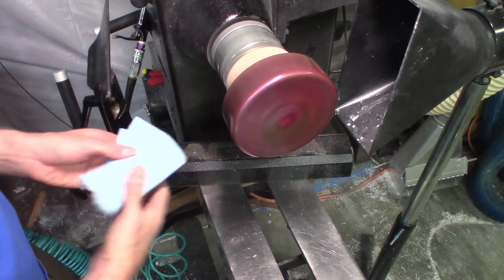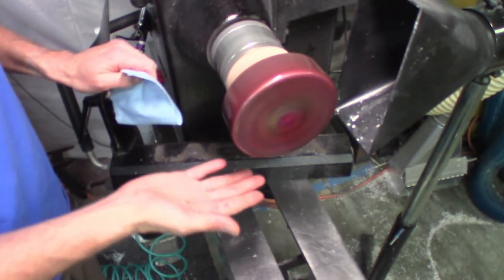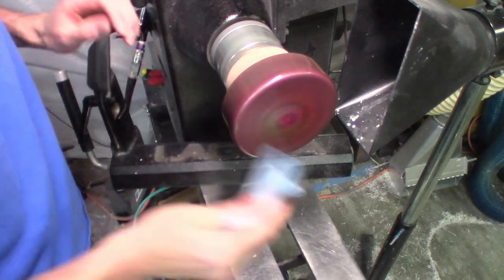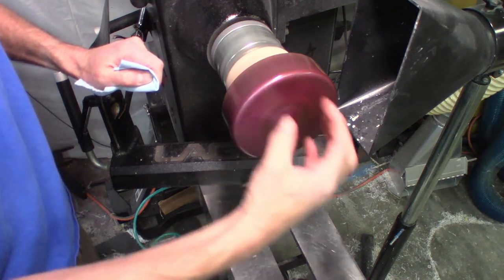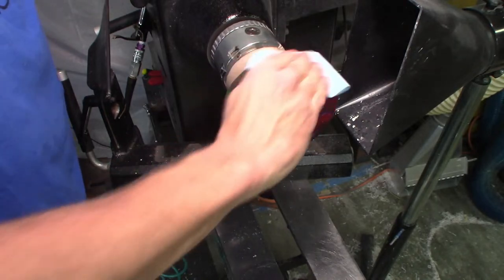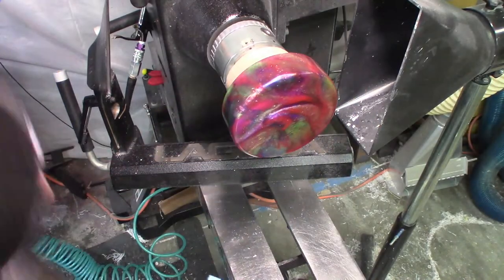I also think that inertia sander tends to not leave scratches as much when I use it. And I would say the drills are probably the same. I don't know what it is, but if I'm doing it by hand, I tend to maybe press harder or something like that. I leave more scratches in it. So, you never know. I also think it does help to do kind of a cross grain if it's spinning. The nice thing about the inertia sander is it's almost like a random orbit sander where it's a random pattern. But on the side, there may be a few little scratches. So you might come with that pad and just do some little circles at the end with each grit, if you're finding that you're getting scratches. Yeah, I can see scratches. Still got scratches on the side there.